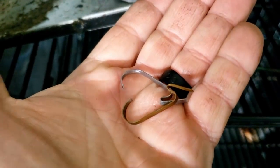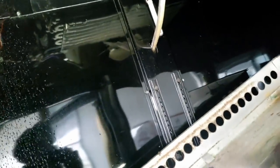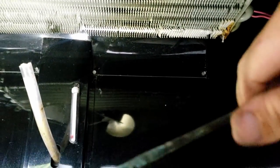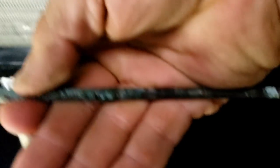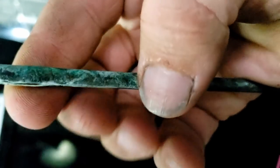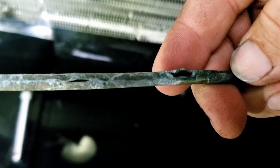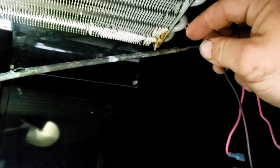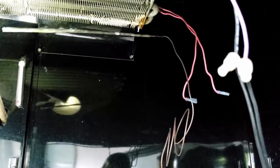I grabbed these little hooks which will come in handy to hold it up here — I'd like to keep the thermostat tube in the same position the factory originally put it for proper defrosting of the coil. Right there — water is getting in there and freezing, then breaking that pipe. I've pulled this thermostat tube in and out a couple times and it's corroded — chances are the thermostat's probably bad. If we don't have a refrigerant issue it's going to be a thermostat sticking.